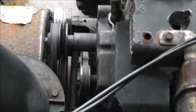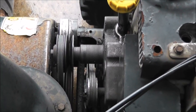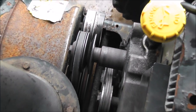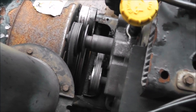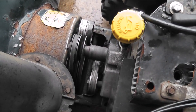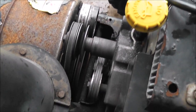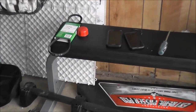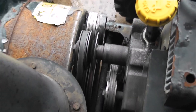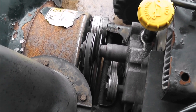The auger on this snowblower uses two belts. This belt here — that wheel is where one of the belts was that broke. There's another one on here and we just had this thing going, and it's got a couple little nicks out of it. I don't like it. There's no point having one good one and one bad one, so we'll put both of them on. Starting fresh with two new belts.